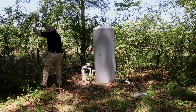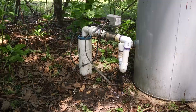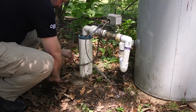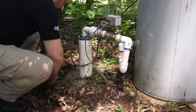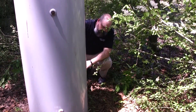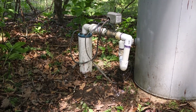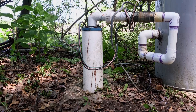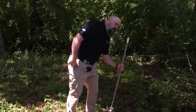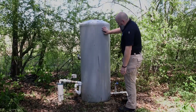To review, when you're inspecting your well site, you want to make sure that your area has a gradual slope away from the site. After removing debris, you do not want any depressions or anything that would allow standing water or debris up against or around your site. You also want to make sure that your casing is in good shape and that your well cap is at least 12 inches above the ground surface. If any of these inspection points do not meet your criteria, you can always call a water well driller who will make the necessary repairs.